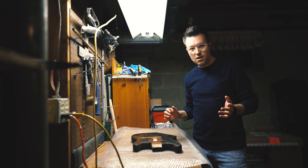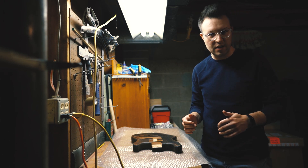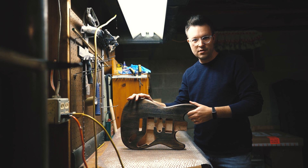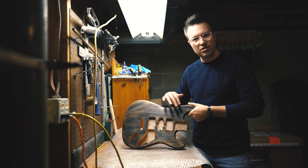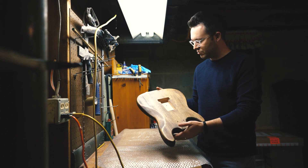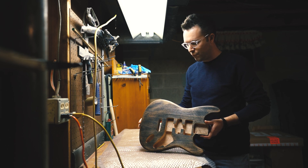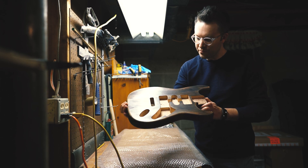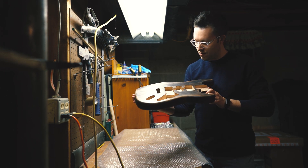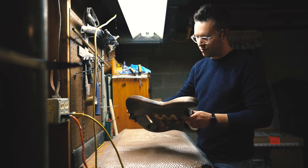Welcome back. I'm going to catch up a little bit — I took the body back after doing the dyeing and didn't quite have enough dye, but that worked out okay because I had some dark stain. After sanding back with 320 grit sandpaper, sanding the black until it looked faded and worn, I put a full coat of dark stain on, and what ends up happening is the grain gets really accentuated from the black dye — you get kind of this tiger's eye sort of look. I'm really happy with how that turned out.